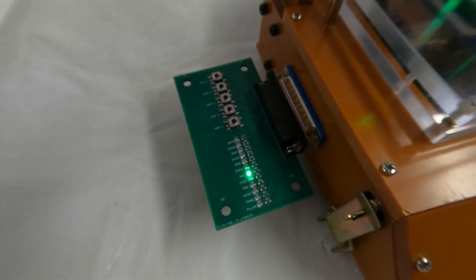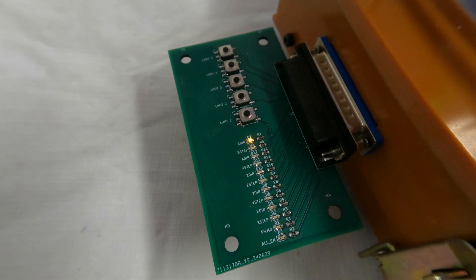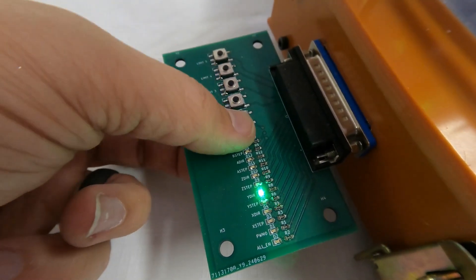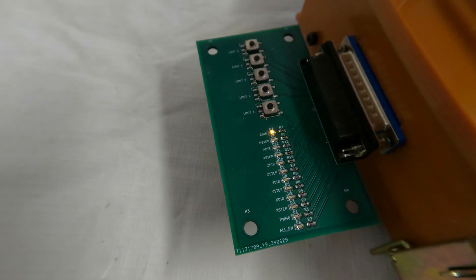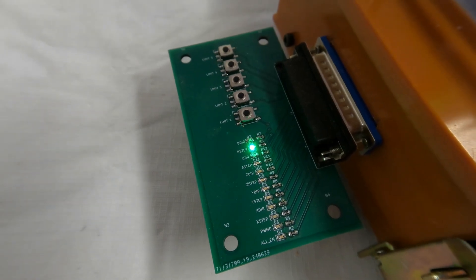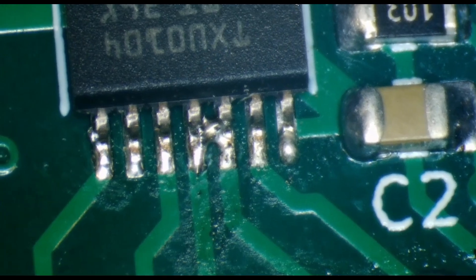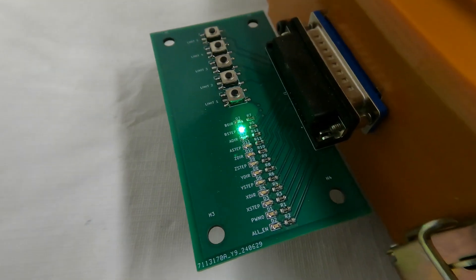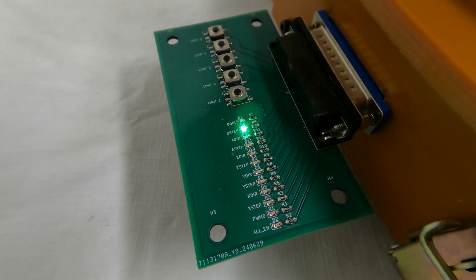The parallel hat has 5 inputs and 12 outputs. This personality board has buttons for inputs and LEDs for outputs. The software needed to test these I/O is a simple C program that uses the WiringPi library to access and control the Pi pins. If a button is pressed or released, it will print out a message. The outputs are cycled all the time intentionally — on a functional tester like this, you don't want to turn on all the outputs at the same time, because a short could exist between two adjacent output pins. By cycling the outputs one at a time, you can visually see a change that would indicate a manufacturing defect.